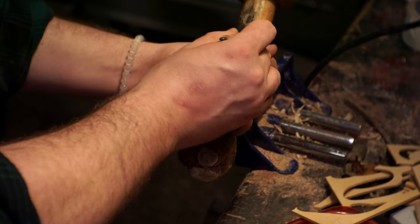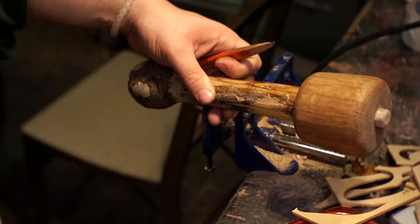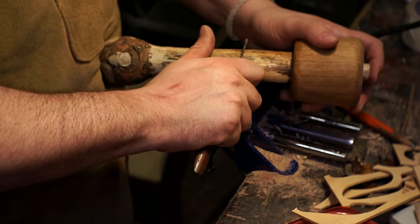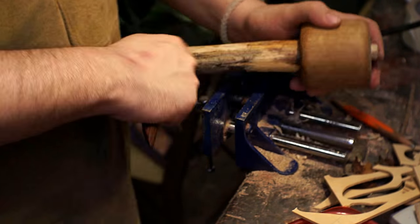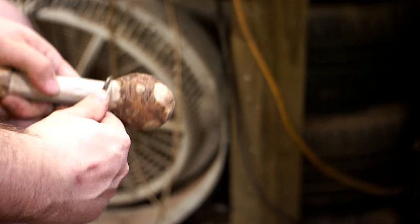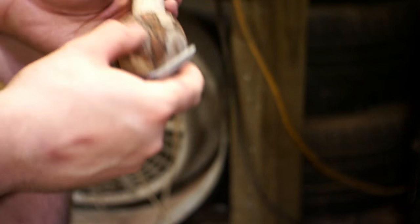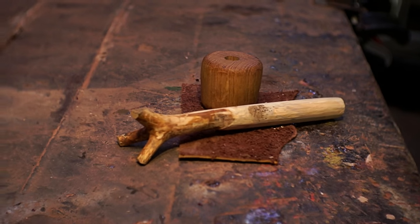With this piece, after everything was dried and cured, I wanted to figure out exactly where my hand was going to rest so I could make a handle for it. I wanted the handle material inset into the wood so there wasn't a lip — I didn't want it to sit proud of the mating surface. So I just took a carving knife and started going after it, and you can see the lip starting to build up giving me a place to sink that material down into.